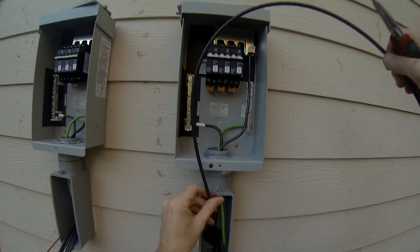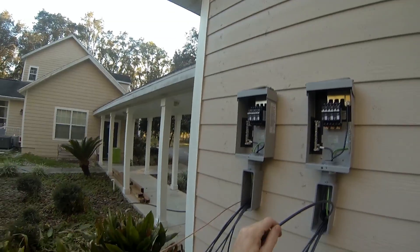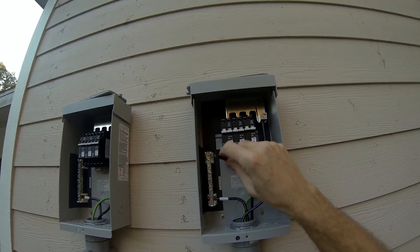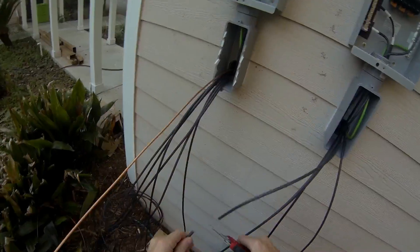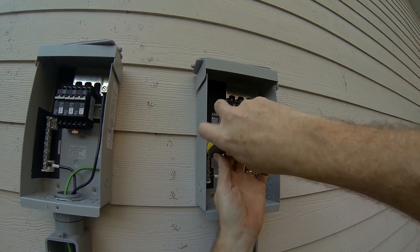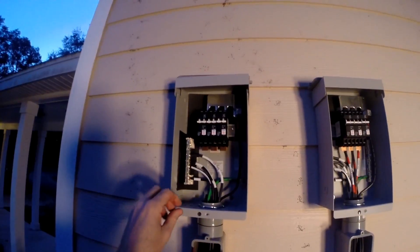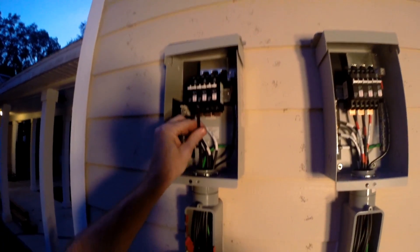Nice — 1A negative, so it's got to come up here and go into here. I'm working on it at night so there won't be any power on here. There's still some voltage, but I don't think there's going to be much current available. It's all wired up — my negative's here, positive's going into the breakers, combined positive out and combined negative out.